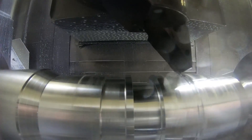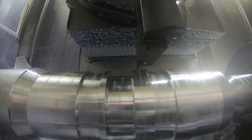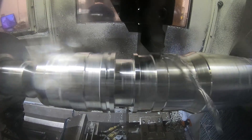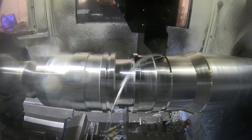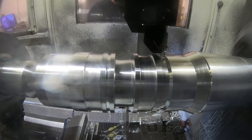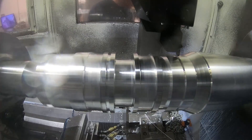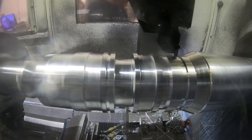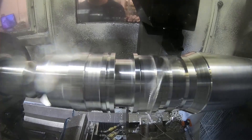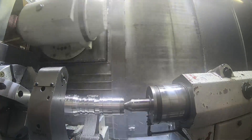It's just roughing out some shallower grooves and finishing the roughing on the deeper groove with a 35-degree diamond, 30-thousandths tip radius VNMG insert. This is a rough grooving tool. The rough grooving tool is an eighth-inch wide top-notch insert, and I'm going to rough these out.